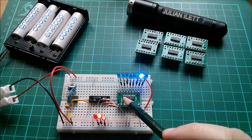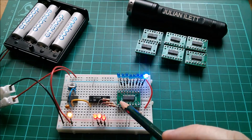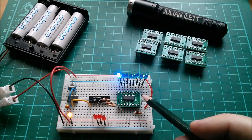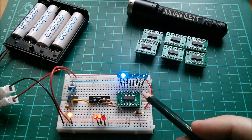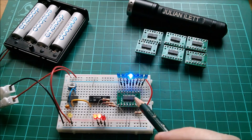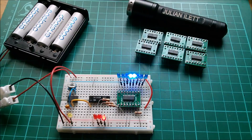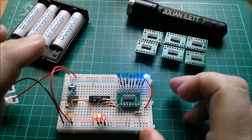But it does work — look, it's sitting in the board. I've had to remark the board with a new pin one identifier because the silk screen says pin one is up there but I know it's down here. That still works — or does it? Earlier in that same video where I built this test rig, I was moving things around and moved the VCC pin.